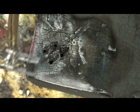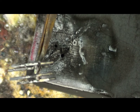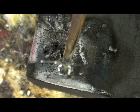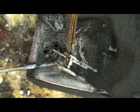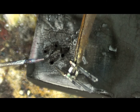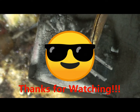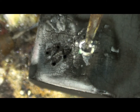And it's lovely. I've got a nice basket setting ready to go. The prongs look fairly evenly spaced. They look 90 degrees to that middle circle here, which is good. It's grubby because I've just soldered it, but in terms of its construction, I'm very, very happy with that setting. So, that's how you actually do the soldering. Good luck, and take it easy. Go slowly with it — little flame, little bit of solder, little bit of flux, and everything should go well for you. Good luck.